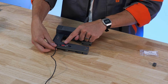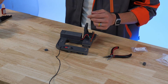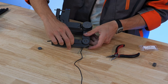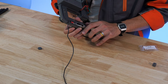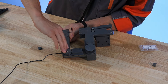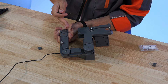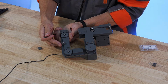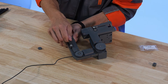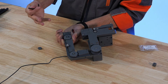With the wire routed down through the bottom, we can torque down the nylock. You could use pliers — so long as enough force is applied to create good electrical contact that's acceptable. This is one of the most robust portions of the system because we're just clamping onto aluminum, so don't be afraid to get it nice and snug. The tungsten carbide block has a convex surface and the wire path is designed to intersect with the block. In practice the wire is going to be pushed to one side, and that's what gives us good electrical contact under tension.